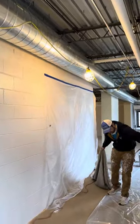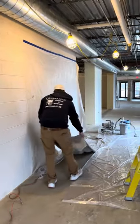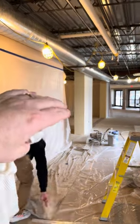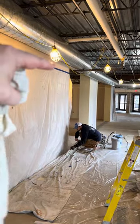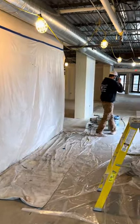We're doing some testing and sample painting on ductwork, figuring out heights. The GC notified us that everything was figured at an eight-and-a-half-foot configuration, so we're going to paint everything at eight and a half. From that line where the duct is, everything up will be black.